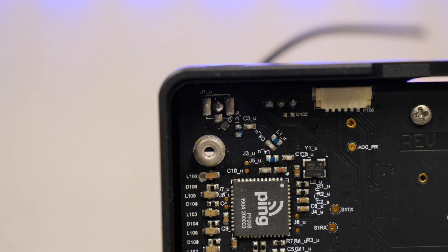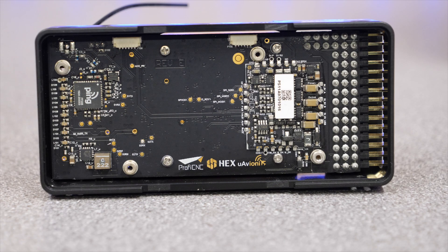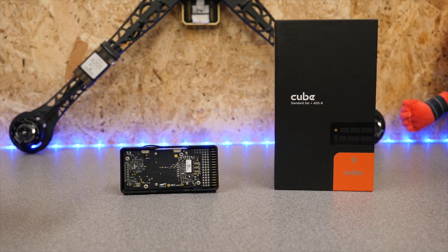If you look at it closely you'll notice it is actually a UFL connector silk screen, and you could solder a UFL connector onto it if you wanted to. However, personally, if you did want to use an external antenna for the ADS-B I would simply solder a little length of coax onto there and then bring the connector outside the carrier and connect it that way, rather than have a connector on board because it is quite small and precise. The silk screen for the connector is there and available for you to modify for your own use. As it stands, Profi do not put the UFL connector on as standard — you would have to do it yourself.